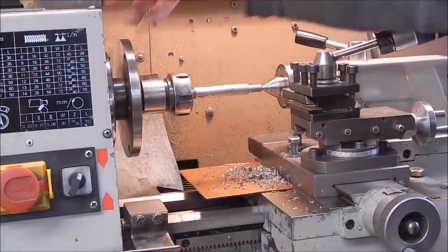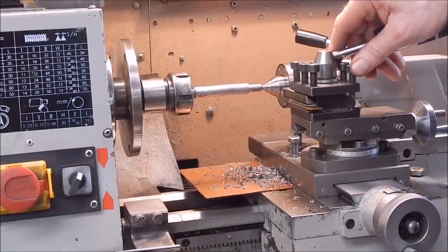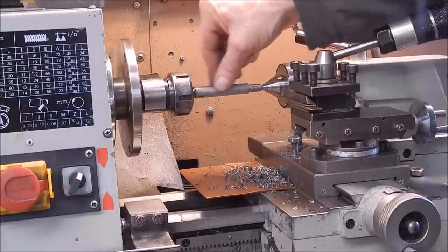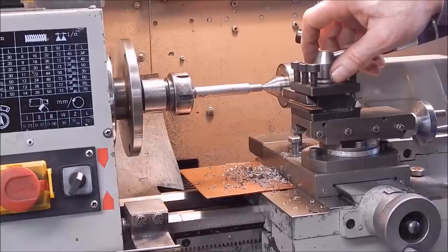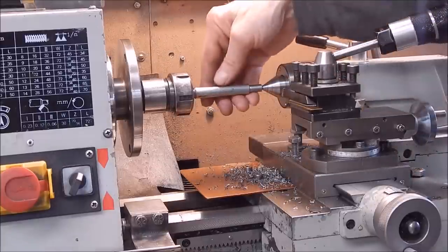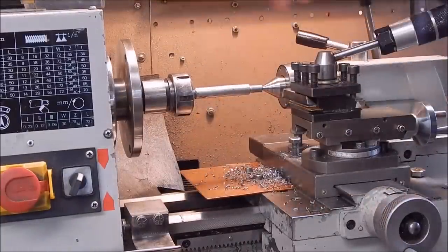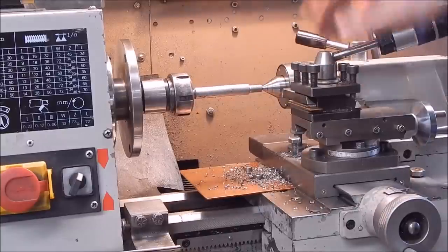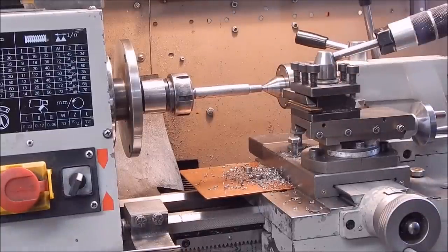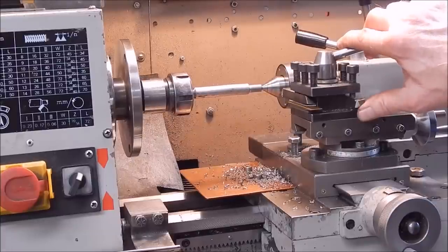With this little carbide cutter I'll just get it down. I've got nothing to spare here — I'm going to have to machine it down to exactly the size I want, then turn it around and just finish the end off. It'll be just long enough to do the job. Slightly longer would have been better, but we'll do this for now. If I get another piece I might make it a little longer next time, but certainly you can reuse all this old crap. I'll swap over the cutters and put it on coarse feed to rip it off.